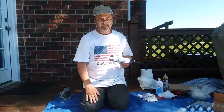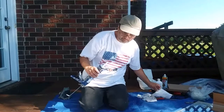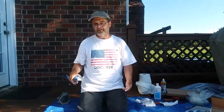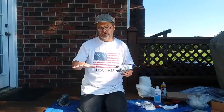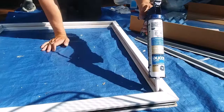I'm going to caulk around the frame inside and then put the glass in. One thing I've learned over time is you want to caulk it and then take your finger and spread it to where it's a thin layer. If I just leave the bead and put the glass in, that'll technically work, but a lot of that silicone is going to ooze out on the other side and then you have to wait for it to dry and use a razor blade to cut that off. If I spread it out to a thin layer so it's acting as a good adhesive, it doesn't make a mess.